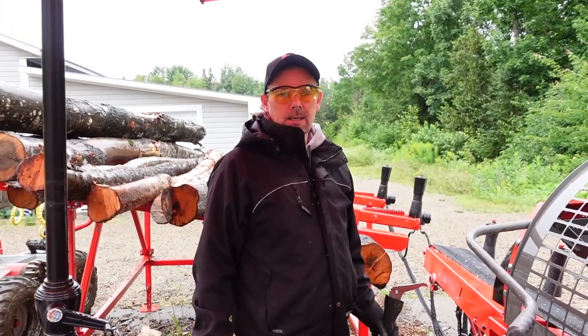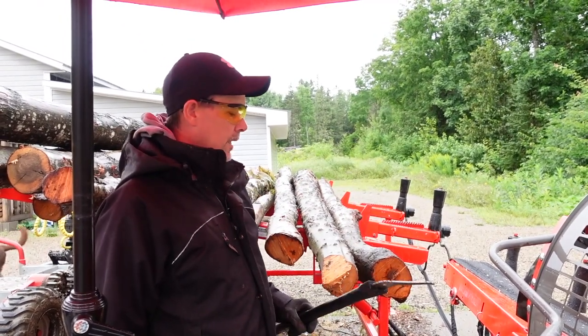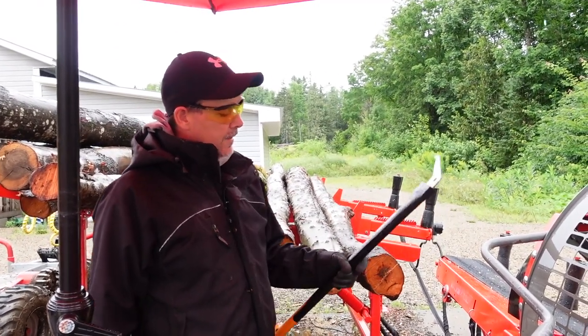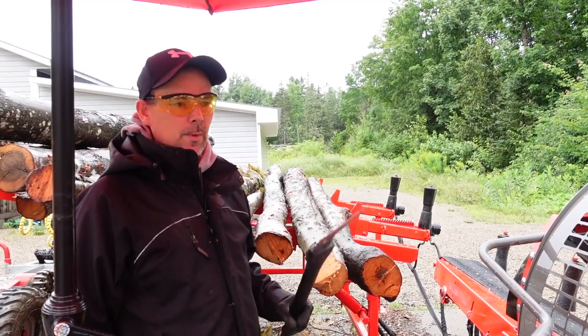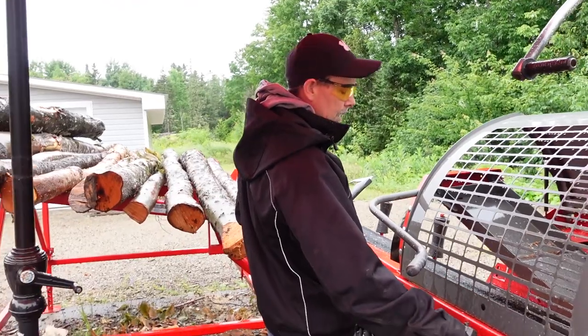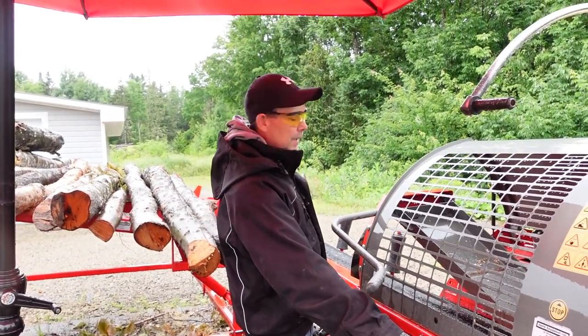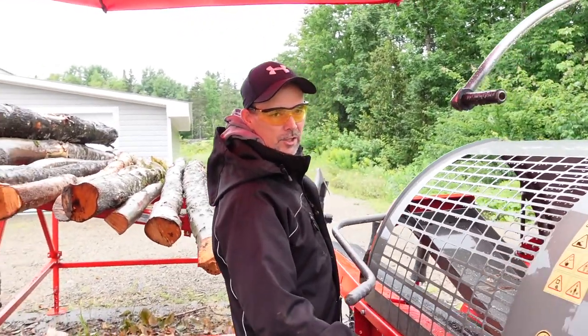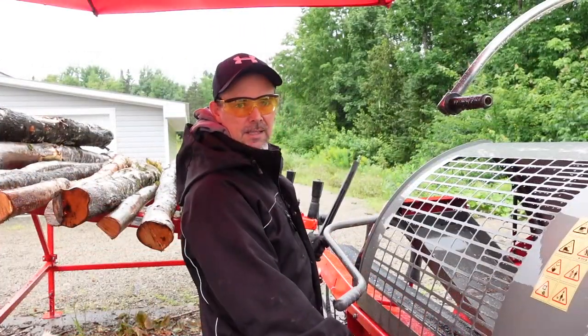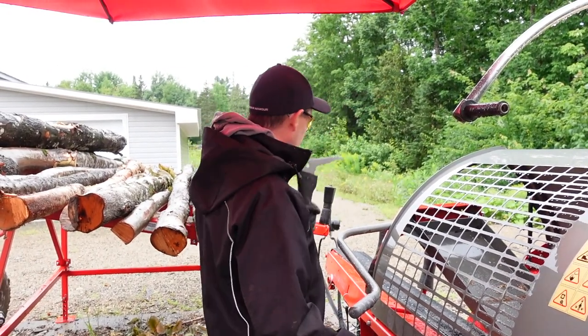Okay guys, another pro tip. Make sure that you have a picaroon around your firewood processor. I'm using a Fiskars XA22. You use what you like. But when you're advancing that control on the conveyor here, if you've got a log caught up over there, you need that extra reach. Plus, you can get a little leverage and just kind of lean into it, and it makes life really easy. So definitely recommend that you have one of these in your arsenal.